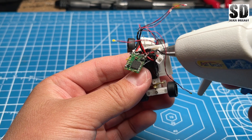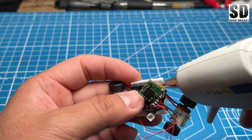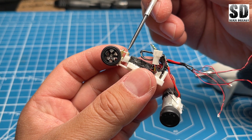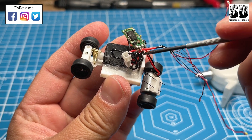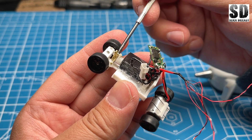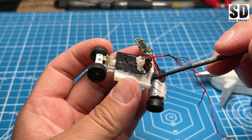I've come to realize that the charging port and the on/off switch are always being handled, so if you don't have a good enough bond between the chassis and the component, it will come off. The issue is right between this cross/connecting bar and the rotating servo — I think in the future I might have to relocate the charging port and on/off switch back to the side here, because right now it is hitting the rotating servo and may interfere with steering. For future builds, these two components would need to be moved back.